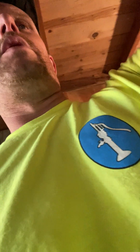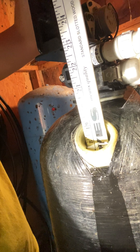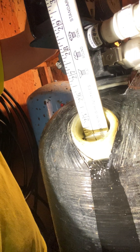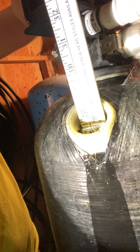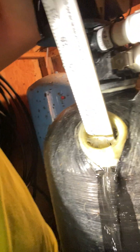These filter heads — the 10x54 and 13x54 — they should all be 18 inches from the top, so we're going to measure this one. There's 18 inches, and it keeps going down to 25. From 18 to 25 is one bag of calcite — that's a bag and a half. So now you're going to pull it out and get a hose so we can siphon it out.